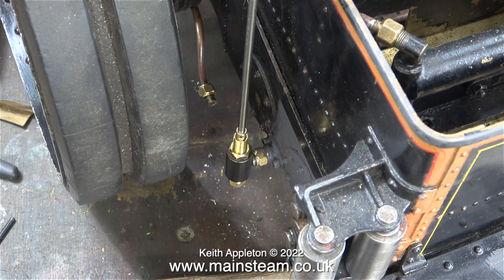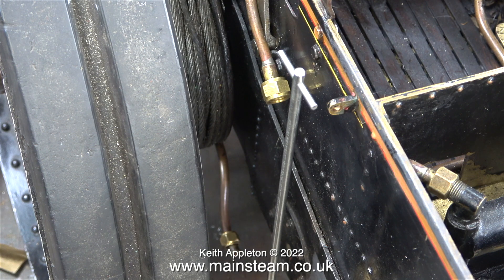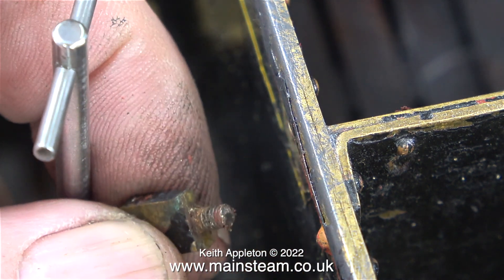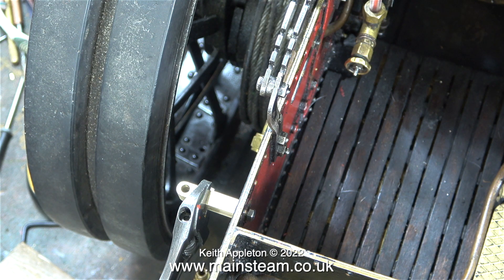Using a very conveniently placed hole in my workbench I tap the piece of steel through the main shaft. Now all I have to do is put it together. It's never a good idea to have a long handle sticking out of a water valve — it needs a support at the top. Here's the existing support that's not in the right place now; I need one with a hole one inch from the side of the traction engine. I made a new support using a piece of square brass — a very simple part to make. All I needed to do was drill a hole in the piece of brass bar to support the handle at one end and a hole in the end of the brass bar which I threaded 5BA to bolt it to the side.